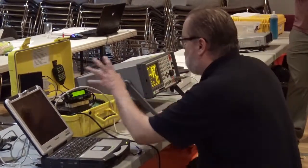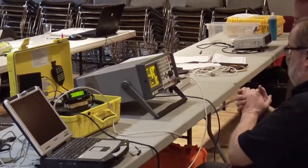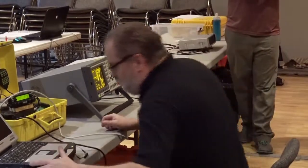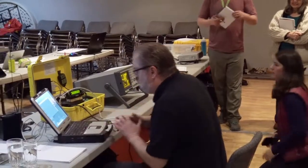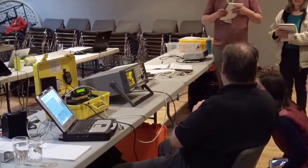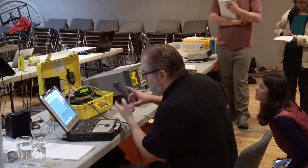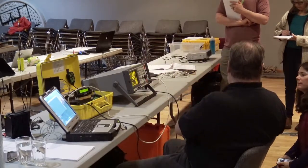Now what the modem does, it modulates and demodulates. That's what's called a modem. They take the first part of each one, and that's the terminology. So it generates two tones. I'll just bring up the terminal here, and we'll go into the calibrate mode. At the prompt, CMD colon, we type CAL. When you hit enter, it brings up a small menu. We have mark, receive, space, square wave. So what we want to do is use a square wave and set it to 2.75